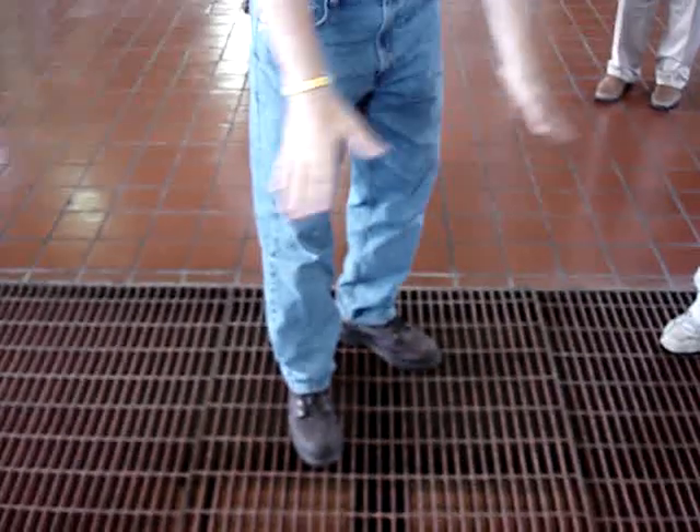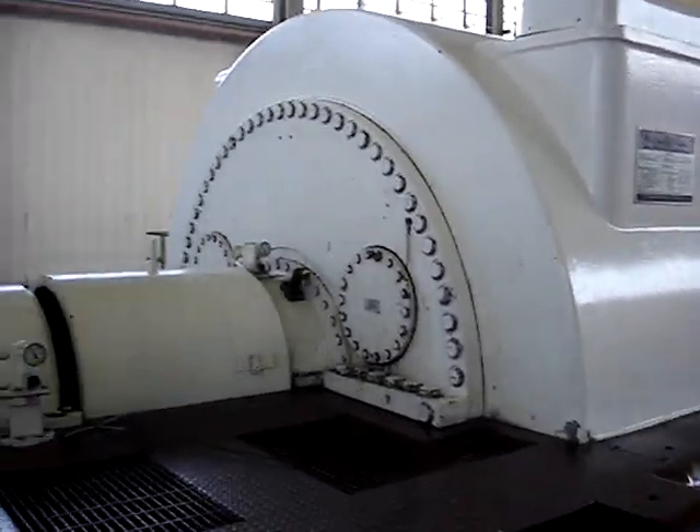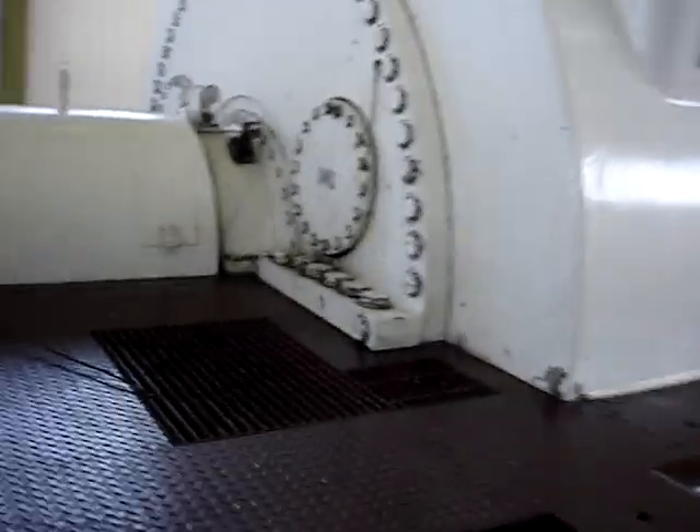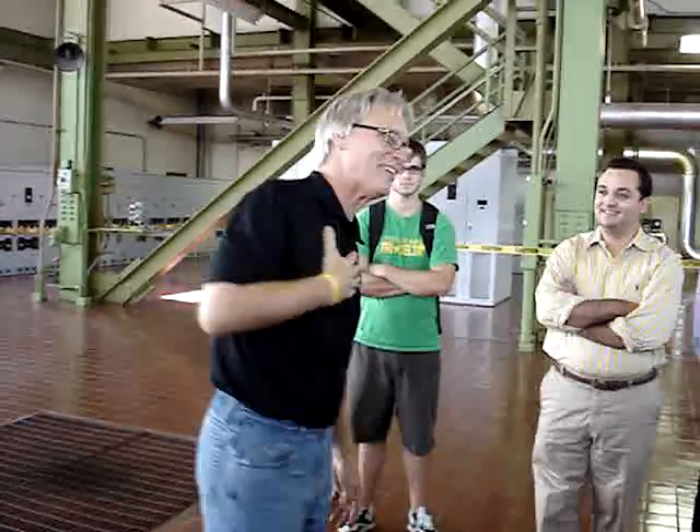If you look underneath us, there's that rounded pipe where all the water from the lake comes in. It takes the steam and that power and pressure, pushes it on through, exhausts, and then channels back to go back into steam on the other side. This turbine and generator are hard-coupled — there is a coupling and it's on what's called turning gear right now. It's rotating on a very thin film. If it sits too long in one spot, the weight of the rotor and shaft would cause a bow. Then when you throw steam through it, you get a rub. That happened to me at Atkins on Unit 5 — I was in too much of a hurry, didn't warm it up, and it was shaking the whole building. People across the street heard it, and it was only a 38-megawatt unit. You had to bring it back down and do it the right way.